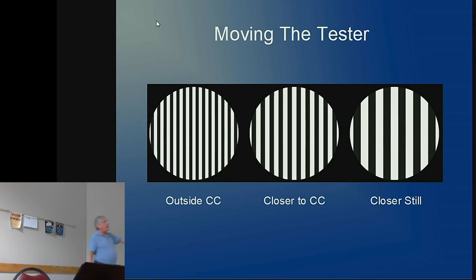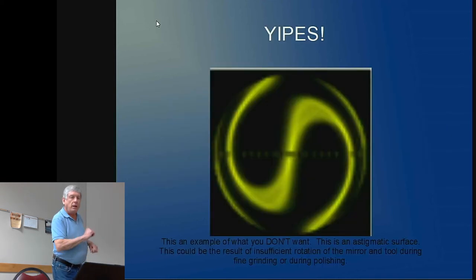It's almost like you have a glass surface that you're illuminating from the edge with a flashlight, and it amplifies the irregularities. And it's really interesting to look at because that can confirm whether or not you've got good contact with your lap. There's a dreaded condition called dog biscuit, where the surface looks like a bowl of oatmeal or a dog biscuit, just lumpy, bumpy. Oh baby, you don't want this.